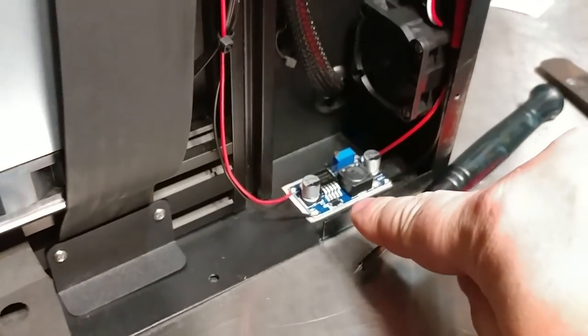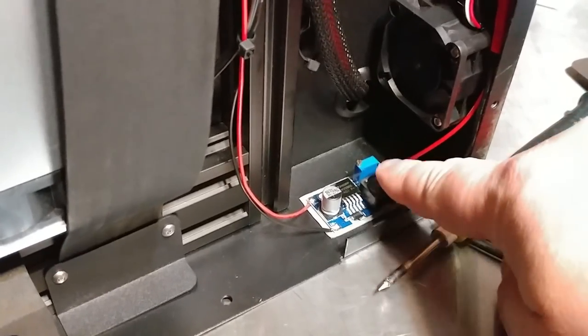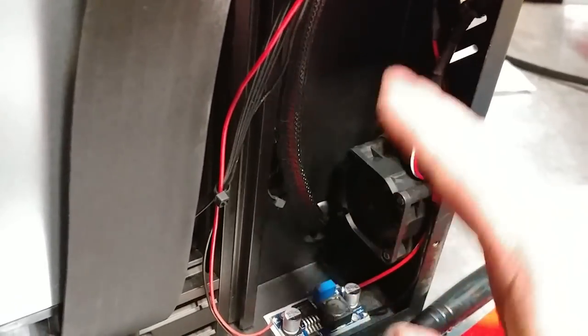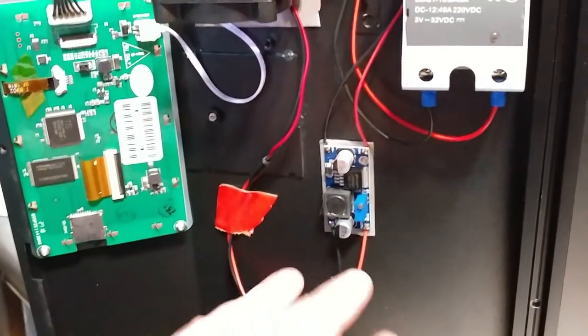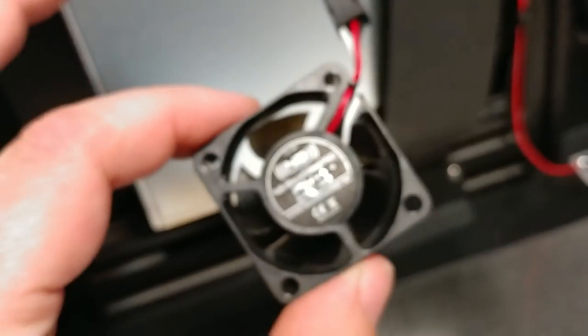I kept the wiring neat. There is the buck converter - adjusted, and I can still adjust it if I need to. It's stuck down with extreme sticky tape so that it stays put and is insulated from the frame. Here's your input, your output, a little zip tie holding this wire in place. This wire is unplugable so I can replace this fan if I need to - it's a little module, easy plug-and-play removal. Same thing here: I put a JST connector on the fan so I can unplug and plug in a new fan. The only other fan is the one in the MeanWell - we'll see how noisy that is once I get it hot again. I believe that fan's on the side - looks like it's also a 4020, so I'll need another one of these if I have to replace it.